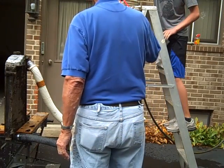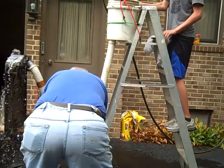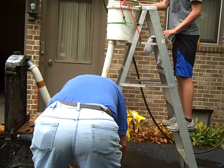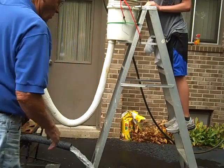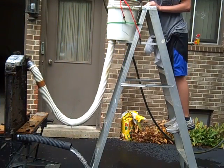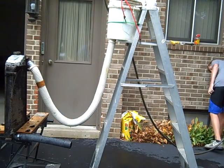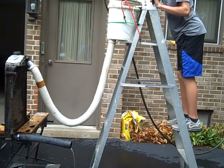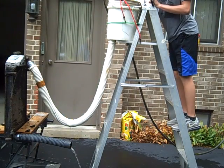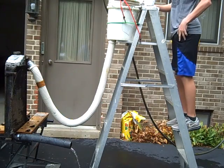We'll try it again. Pull the plug. I held the bucket under there 3.35 seconds, and then we measured how much water was in the bucket with a measuring cup — 250 ounces. We ran the calculation on that, and that baby flowed 35 gallons a minute.